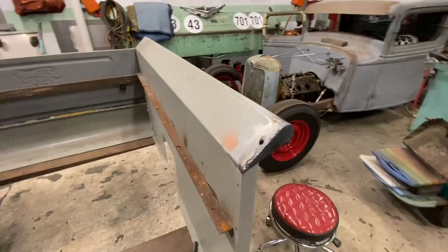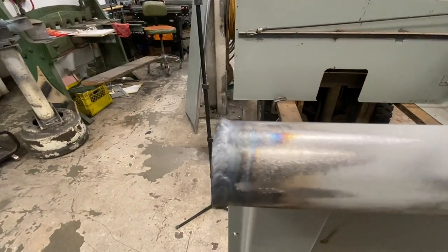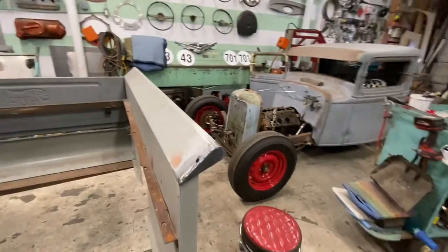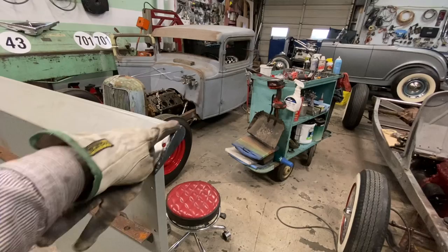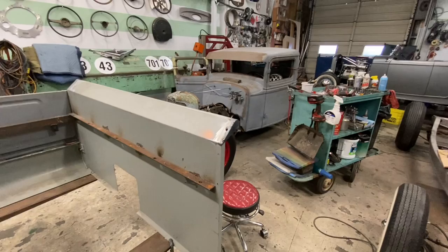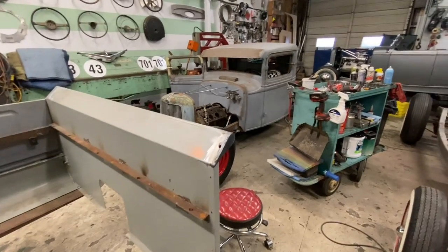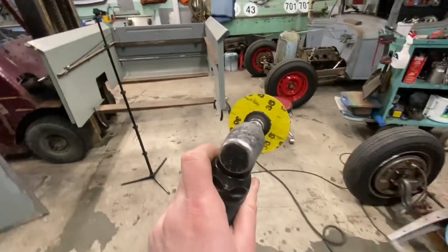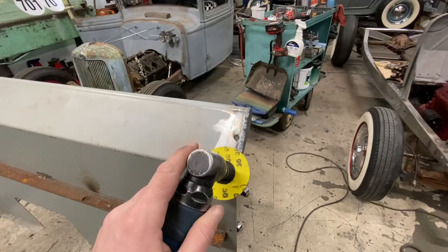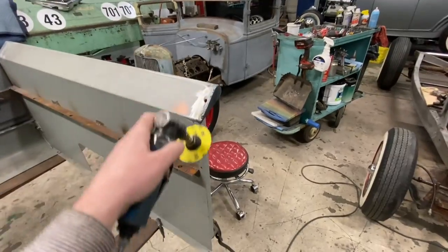With this all welded up, we can go ahead and start grinding it smooth. I wasn't super concerned with making super pretty stack-of-dimes welds — I was more concerned about getting fill and penetration, because we want to grind this flush with no evidence that we ever welded in there. You want to make sure you've got good build on there, and if we have a couple spots when we grind it out that need to be touched up, that's no big deal. To grind this, I'm going to start with a 36-grit disc on a little 90-degree grinder and focus on making it flush. You want to make sure you don't dig grooves in — keep it nice and flush while you're grinding.